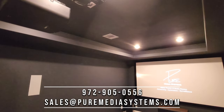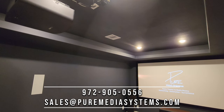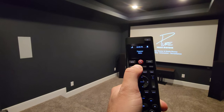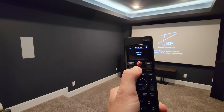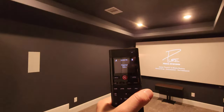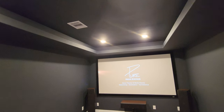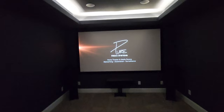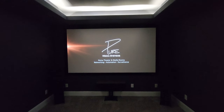We've gone ahead and programmed custom buttons here. Custom button one turns the light strip on and off. Custom button two dims the lights to 25% and turns it off — we've got conditional programming so that if it is at 25% it turns off, and if it is not at 25% it turns to 25%. Custom button three is just a toggle, so it turns it on and off. So we can go and turn this off or go ahead and show you a demo of the system.